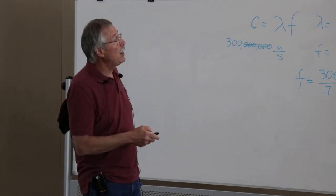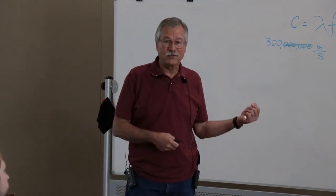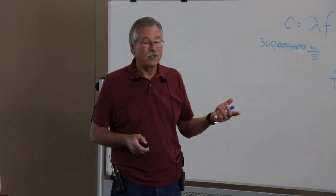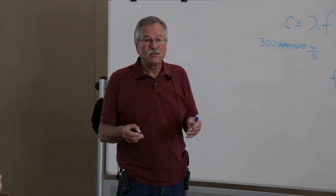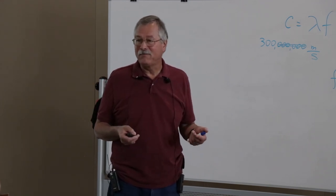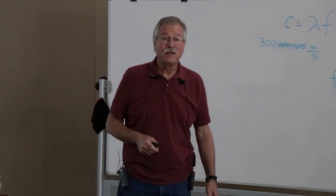On the other hand, we're only occupying how much? 3,000 hertz instead of 6,000 hertz. So single sideband, which is the technical name for it, is much more efficient by double. And so on the HF ham bands, everybody uses single sideband because we can pack twice the conversations into a given space. Mostly upper sideband?